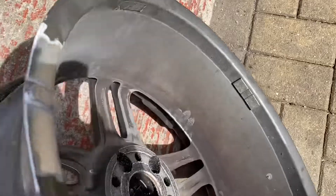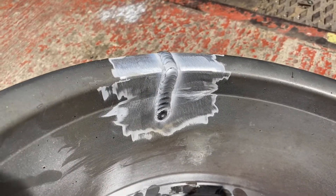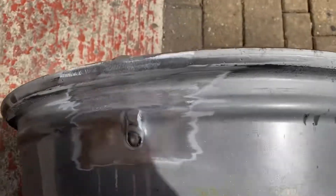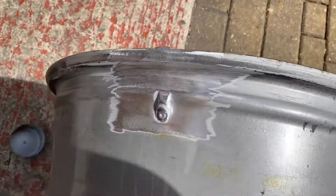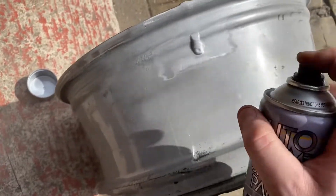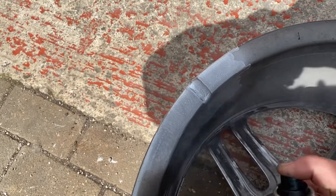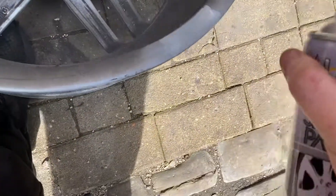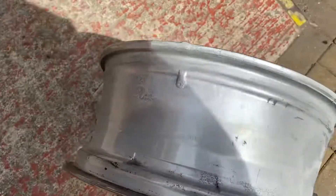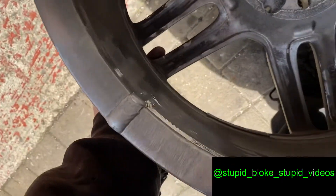Now we are pretty much finished. On that side we've got a nice smooth bit for the tyre to fit. You can actually take the weld off if you want to, but I just leave them on because more metal equals more strength — even though there are arguments against that. Next all we're going to do is just give it a bit of paint. Like new! So there we go, that is how I weld wheels up. Don't forget to like, comment, subscribe — all the usual. I'll see you next time.